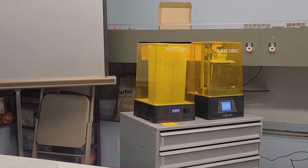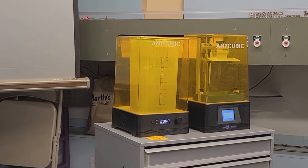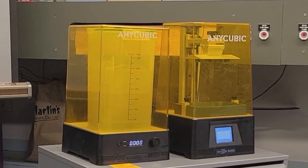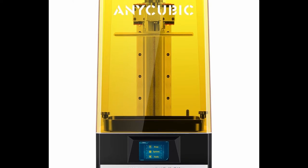With FDM, the parts are ready right off the printer — once you print it, you take it out and it's good to go. FDM is really popular with guys in motorsports because you can mock up brackets and take them right off and put them on the engine to see if they fit. The DLP is more for modeling, figures, and scale modeling. So we have a resin vat and a build plate using light for DLP, versus a heated nozzle building up filament for FDM. They both have pros and cons. There's also SLS — selective laser sintering — which uses a laser as opposed to a light source.